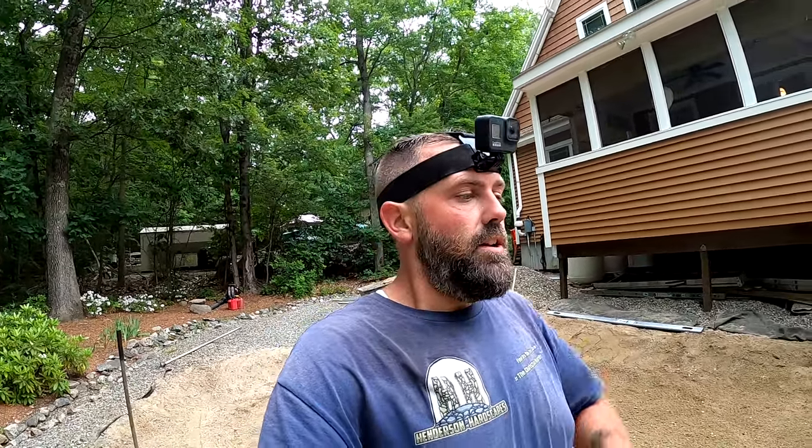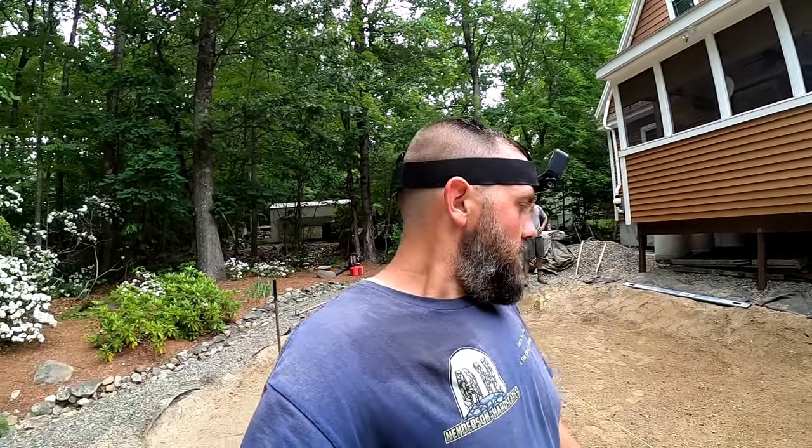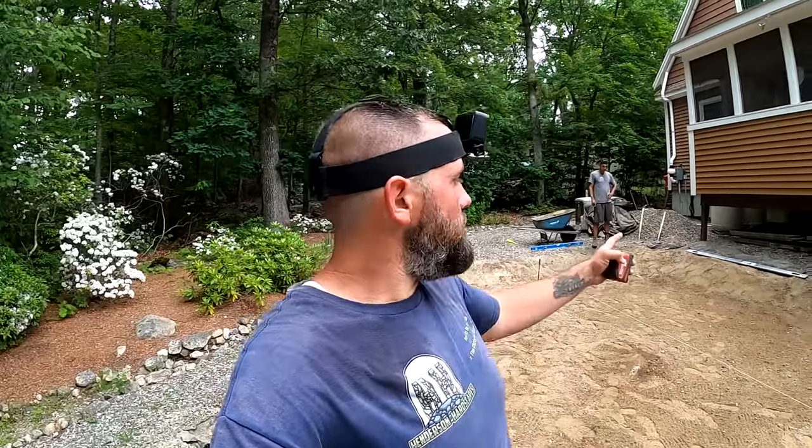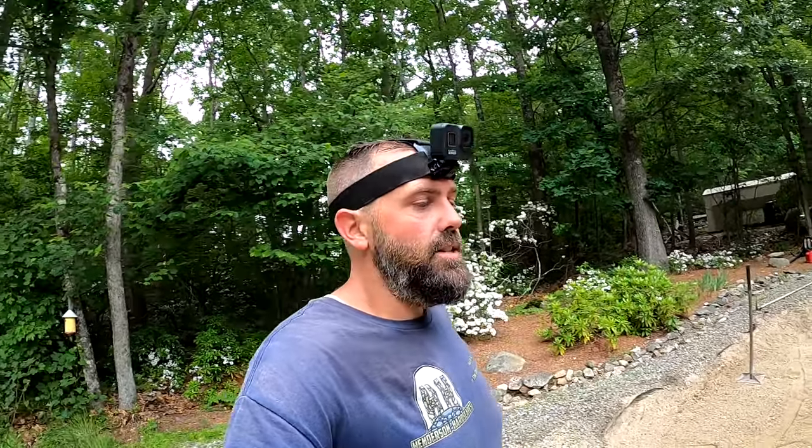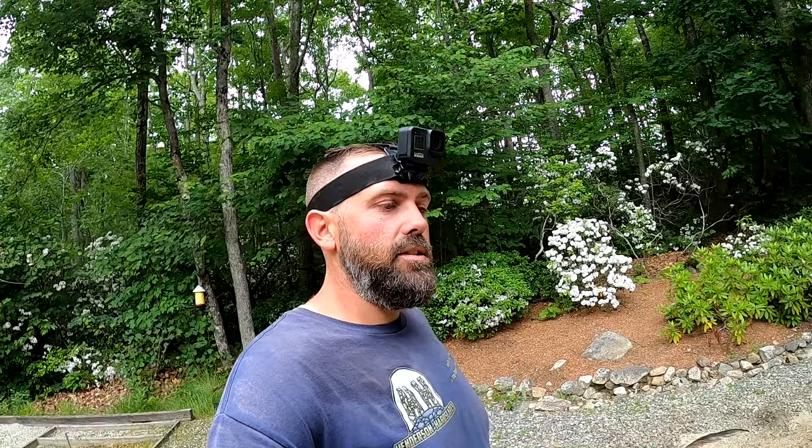We usually go between the 8 and 10 range, and if you go a little bit more, it's going to do nothing but help. So everything's good. We checked it that way with the screed, so our subsoil is at a perfect height. And what we need to do now is what you've probably seen on a lot of our videos. We're gonna lay out a thin layer, 3/4 inch stone, compact it into the subsoil to strengthen it up nice.